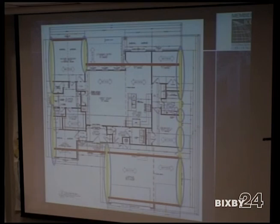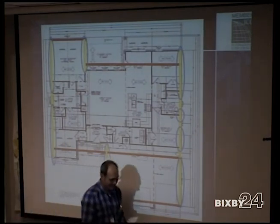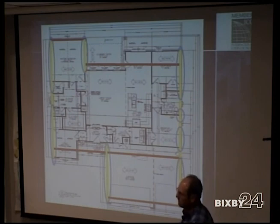If I didn't have that one, I could be able to count that. Well, yeah, if there was no plate height offset here, that can be a braced wall panel. This cannot because you don't have enough room. You can resize windows or move them down a little bit or whatever, but still, you're not within 12.5 feet. This panel here is not within 12.5 feet from the end. So no matter what you do over here, you still have to address the first braced wall panel, which has to be within 12.5 feet from that spot right there. No matter what.